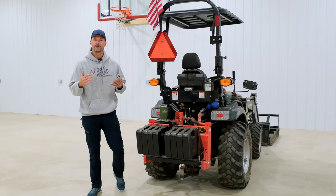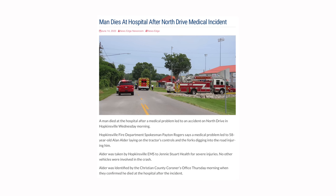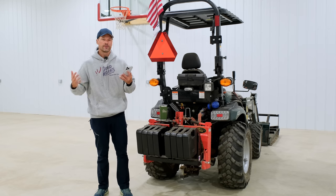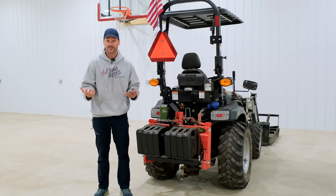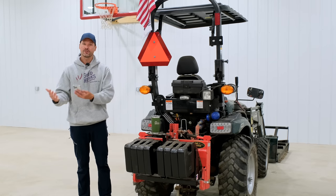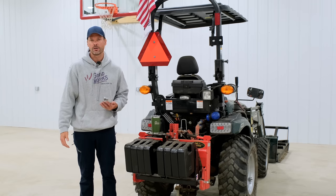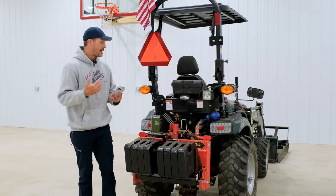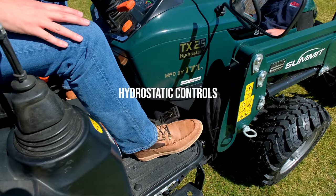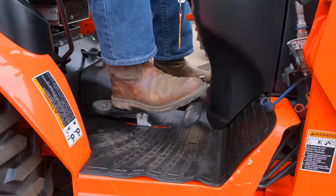A gentleman had a medical emergency while driving down the road with pallet forks on the front. The tractor kept going, the forks dug into the road — he was slumped over, the controls were still engaged, the tractor was still in gear, and an accident occurred. This makes a case that a hydrostatic transmission is safer than a gear drive, because with a gear drive the machine just keeps going. With a hydrostatic, you have to physically push down on the pedal to make it move — if pressure comes off the pedal, it stops. That could be a much safer scenario.